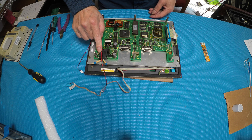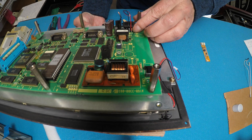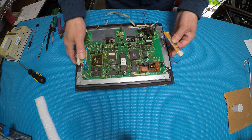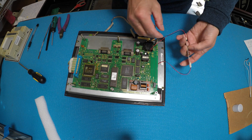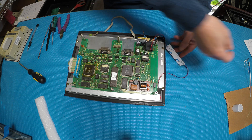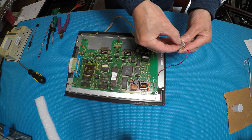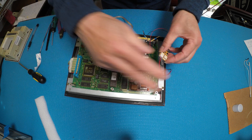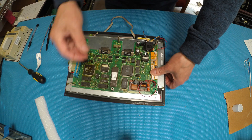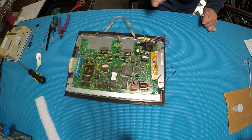Solder the red wire to positive 24 volt and black to ground, direct to the input connectors like this. Basically you just connect this end - you can connect either one - and connect this end to here. I'm going to mount it right here, perfect. Peel off the double-sided tape - of course, clean the surface a little bit first - then simply peel it off and stick it down just like this. Then we can secure both wires and fire up to test it.